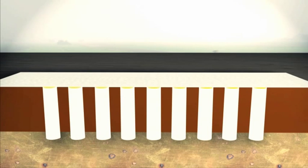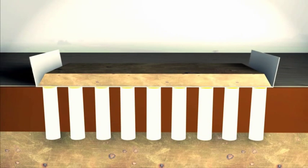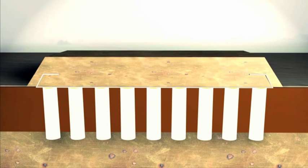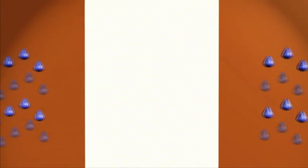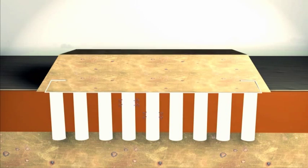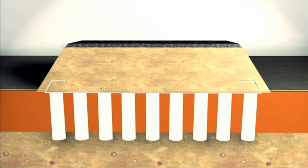As the load upon the columns grows due to the incremental increase in height of the overlying embankment structure, the columns expand slightly and therefore produce tensile ring forces within the geotextile sleeves. Additionally, the encased columns act as mega drains, increasing the vertical consolidation process of the soft soils, and the improvement of the ground bearing capacity continues as embankment construction progresses.